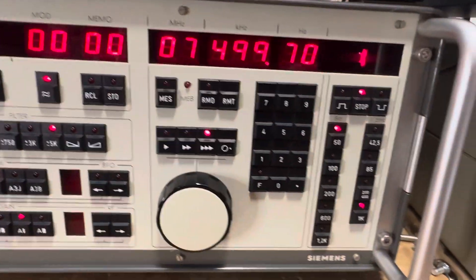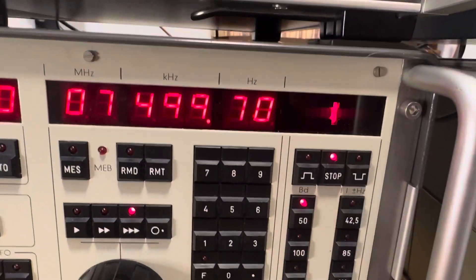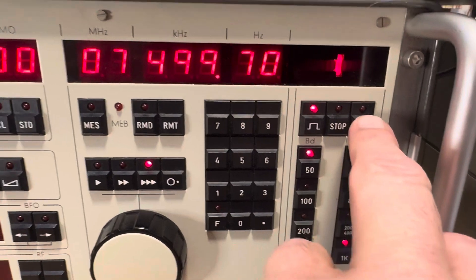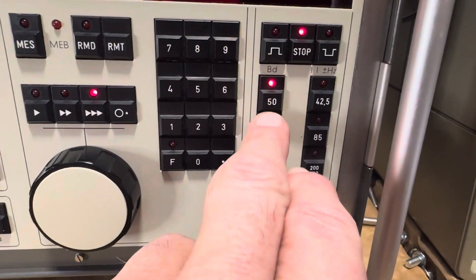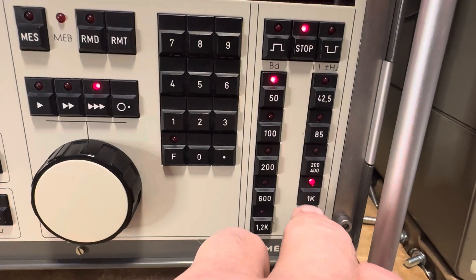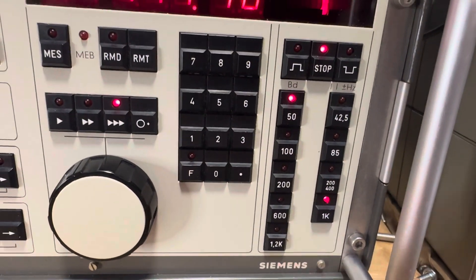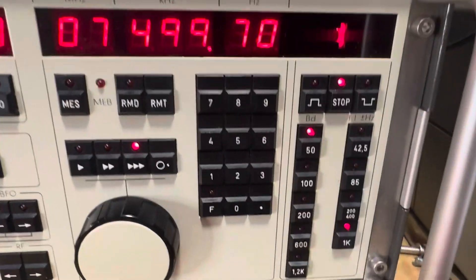This section here is interesting because it's a fax decoder. You have different selections — this would show you the output if you were printing to a printer. You have shift up or reverse. Then you have your different bauds — the data speeds. And then you have the hertz offset, what I used to call shift. Those are all fax settings specifically, so you'd hit F1, 4, and then come over here and use that too.